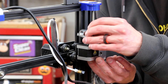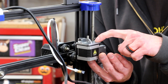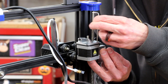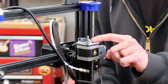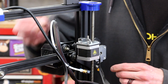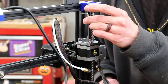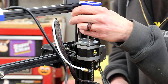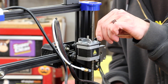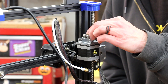We'll bring our stepper motor back into place. The first bolt I'm going to put on is the back one that gets covered by the lever — this one takes the little tapered Allen head. I'm not going to tighten it down right away because I want to be able to move it around to line everything else up. Now that I have the other two in, I will snug this one down. I'll grab our lever and that is our fourth screw.